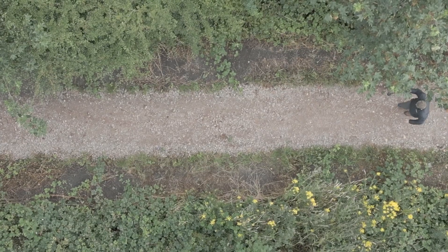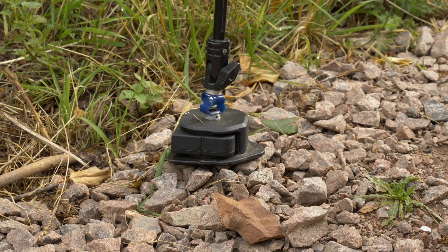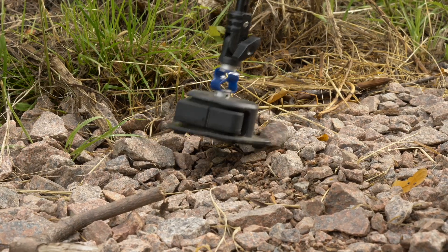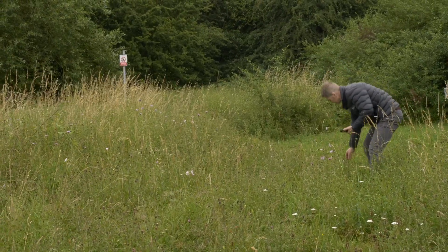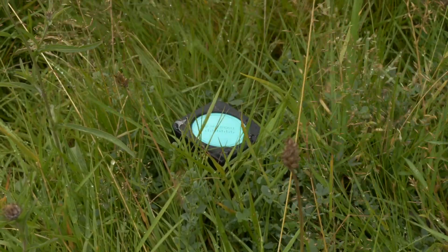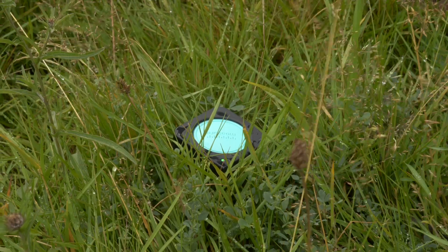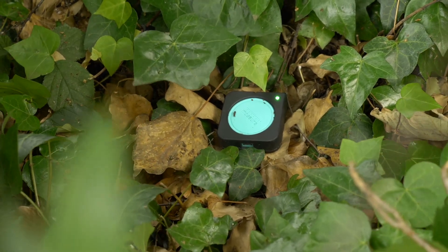When it comes to rocky terrain, I'm not going for a slam dunk when I place the device down — I place it down gently and it is worth taking extra care about where I place it. I look out for uneven rocks or pebbles that may move beneath the Mosier chassis, causing a wobble and leading Mosier to believe you're still in the measuring process. Remember, you don't have to use the stick — I would recommend in areas that are overgrown that you go handheld. That way when you place Mosier 1 down, you know it is not moving and will definitely capture the point.